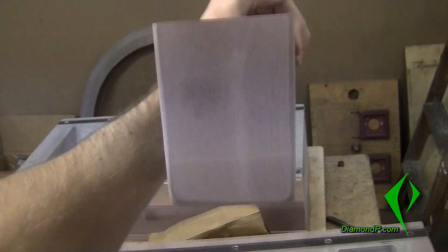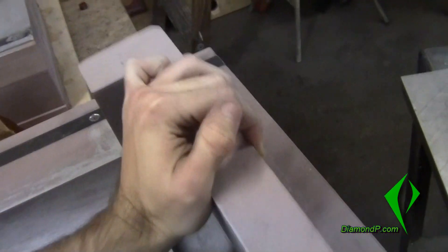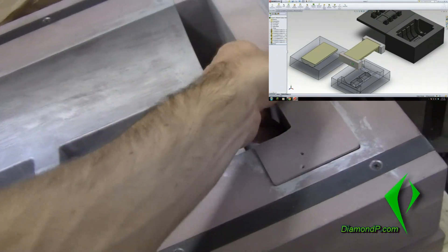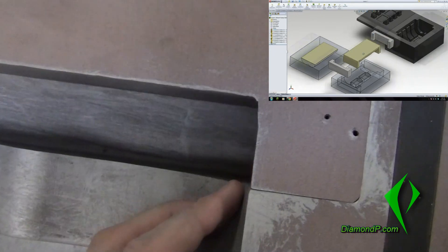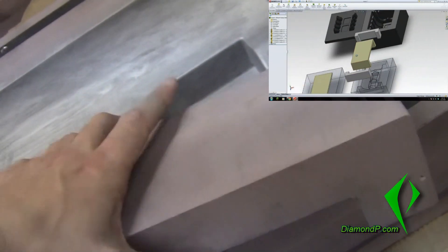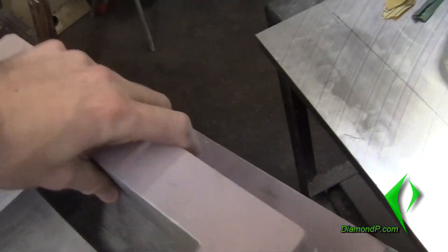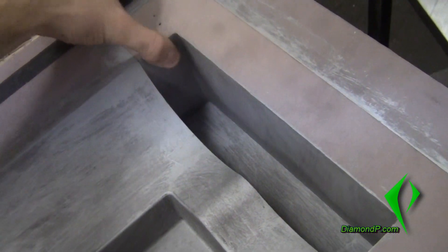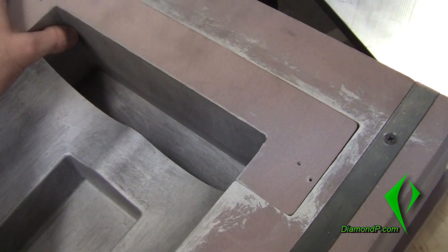The loose pieces are made with positive draft in relation to the core box parting line. What that will do is when this is filled with sand and the sand hardens, then when we flip the box and dump it, the loose pieces will actually fall out with the sand. Then we just pull the loose pieces off, because this actually has a one degree draft so that when the loose pieces are dumped and sitting there with the sand, we just pull them out and then put them back in the core box and make another core. Now we like to stay away from loose pieces because this moves a little bit, and while it's not a lot, it can still affect the core when we put it in the mold and cause core shift, which could cause a bad casting.